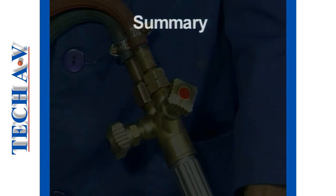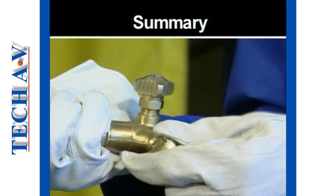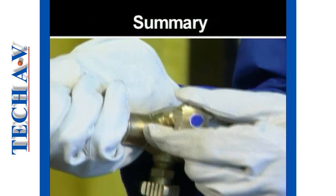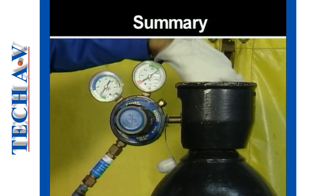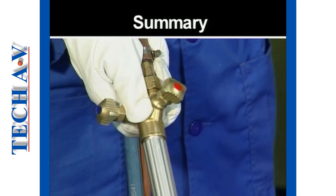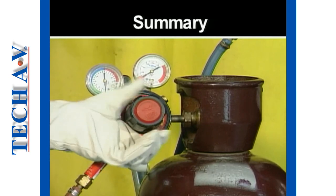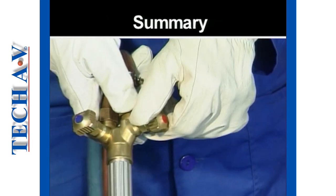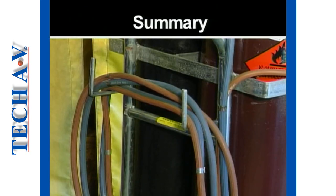To summarize the shutting down procedure, always shut off your torch by first closing the acetylene valve and then closing the oxygen valve. Close off the main cylinder valves and then drain the gas out of each hose by opening the torch valves one at a time. Set the pressure adjusting screws to minimum and then close the torch control valves. Complete the shutdown by wrapping the hoses on the support brackets of the trolley.